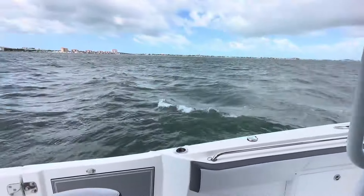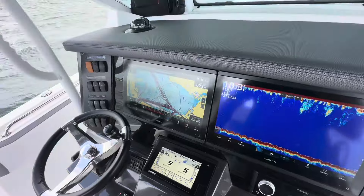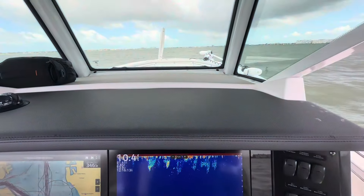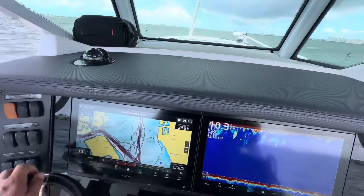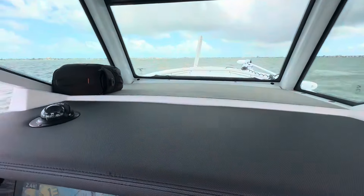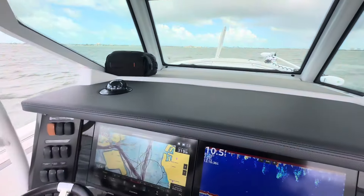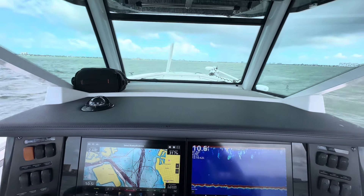Today in this bay, it's obviously the wind that's blowing really hard. So I'm going to get the bow of the boat into the wind. It is 10 feet of water, and when I'm using a rope setup — anchor rope — I'm going to use a five-to-one scope ratio. That's my general rule of thumb for good to average conditions like today. If it's poor conditions — high winds over 20, rough — I might go seven-to-one or even eight-to-one. But today, five-to-one will get it done. Five-to-one in 10 feet means I need 50 feet of anchor line out ahead of the boat.